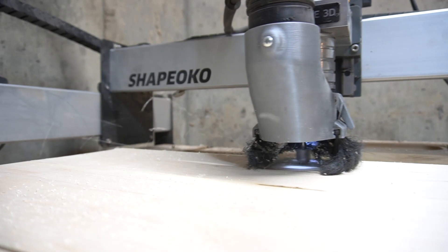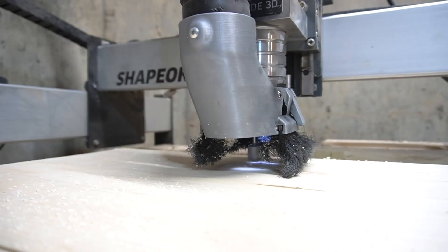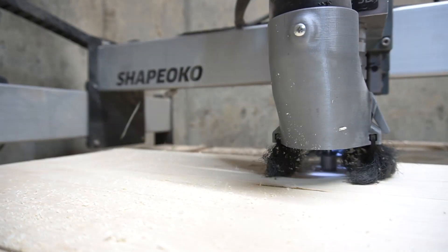I really reduced everything down to three different types of bits: the up or down cut bits, the V bit, and a bowl and tray bit. With those three bits, I can pretty much accomplish 99% of what I do. I'll leave a link to those in the description for you to check out — it's a great starter pack where you're going to use these three bits and not waste a lot of money.